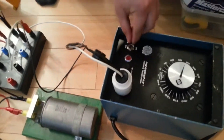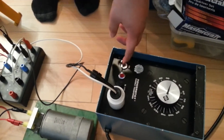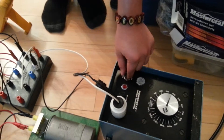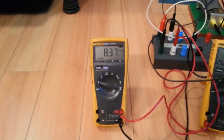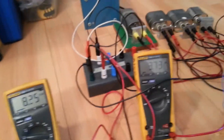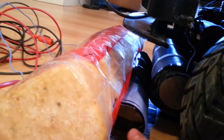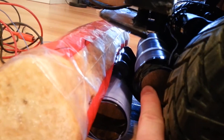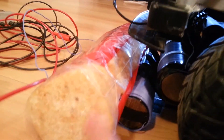This switch right here, which is fixed to an auto transformer, is simulating a fixed transformer in real life and a photo-eye that will detect the vehicle when it's already parked inside the garage. So that turns that on. You can see we have about 8 volts coming from the supply and 3.7 amps. That goes through this primary coil, and it induces a voltage and current in this coil that's mounted on the vehicle.